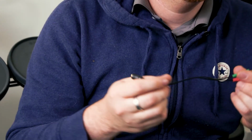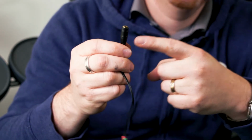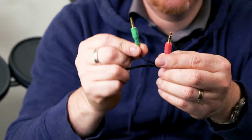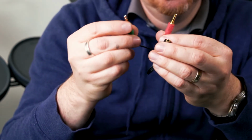So what you can do is you can head over to eBay and you can pick up one of these things. I'll leave a link down in the description on where to find one of these. But essentially, it's a cable that adapts from, just like the Rode SC3 cable, it adapts from your tip ring sleeve, like the headphones that comes with your smartphone, but this time it's got 2 connectors. So one's actually for headphones, the other one's for the microphone. So what we want to use with this is the microphone cable, and you can just leave the headphone cable disconnected. But that will allow us to connect for a matter of like $3 or something, I think this costs.